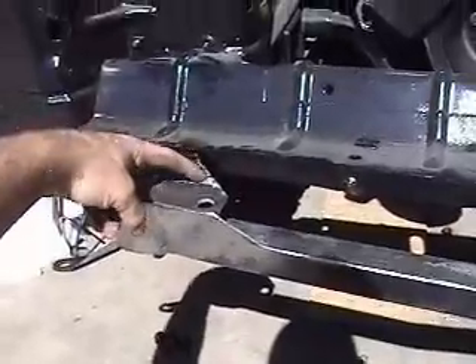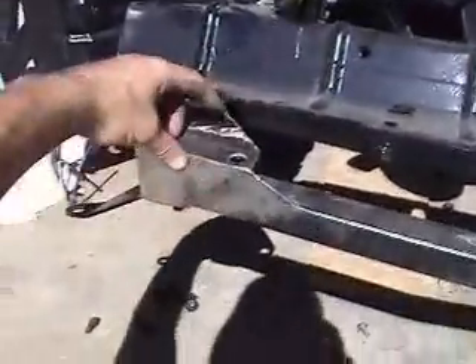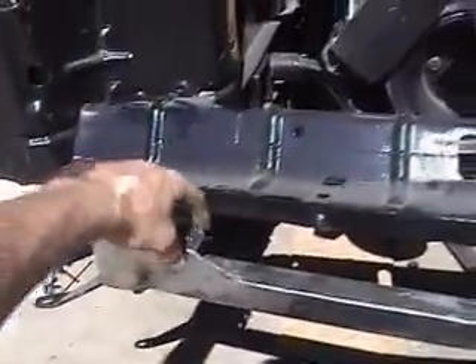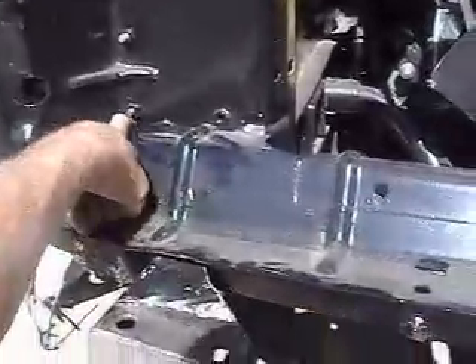I don't think I explained this very well yesterday. This middle piece of the grill goes down in between here and bolts to there, but as it goes down it's always hitting this edge. I think they did this particular angle to give it strength in case there's a front impact on the bumper — they never took that into account, just slammed it down there and threw paint on it. So I'm going to round this out, and by shoring up all of this it takes the place of some of the strength from what I'm going to take away.